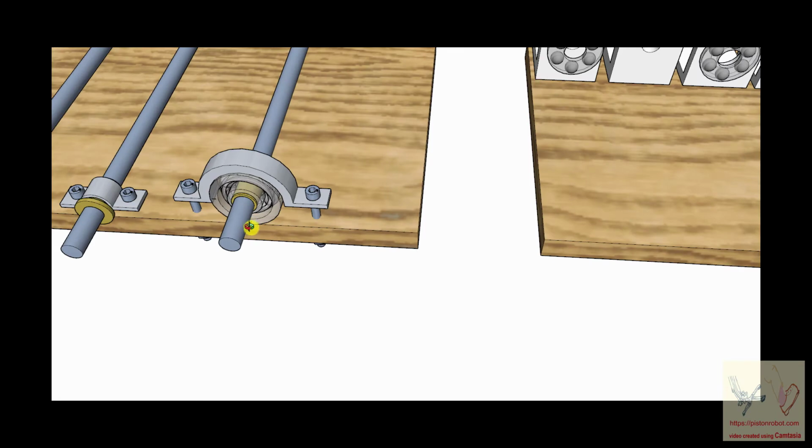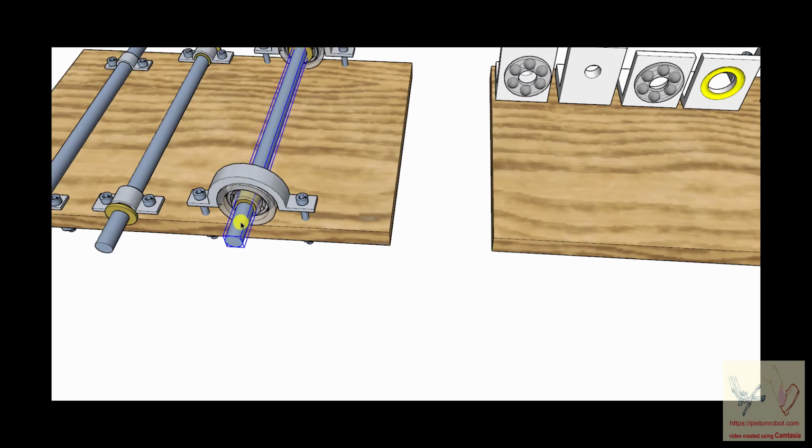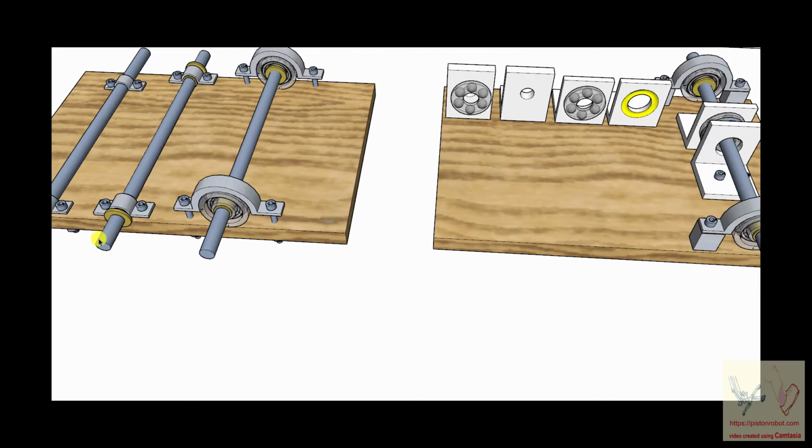You might say, well, there you go. But somebody might bring to your attention, you know what? What if the shaft wanted to do that? And that is because this is considered the axis of the shaft, the long axis of the shaft, and motion in this direction is considered axial motion. Axial motion is a different motion. It's 90 degrees apart from radial motion. If you want to stabilize a shaft against axial motion, then you have to have an axial bearing, which is referred to as a thrust bearing.